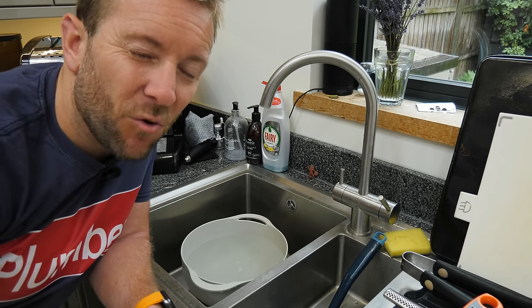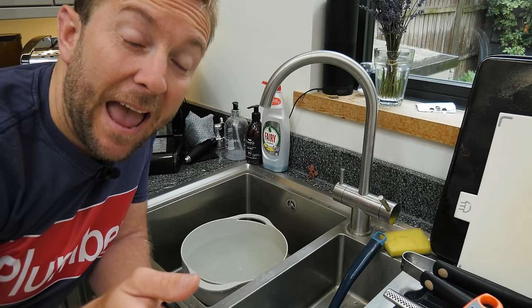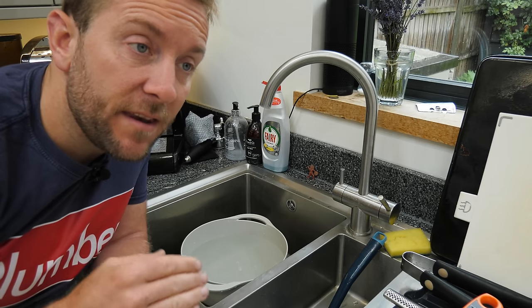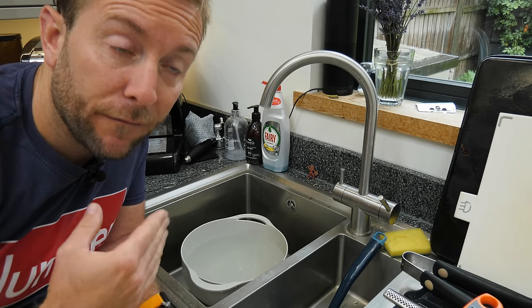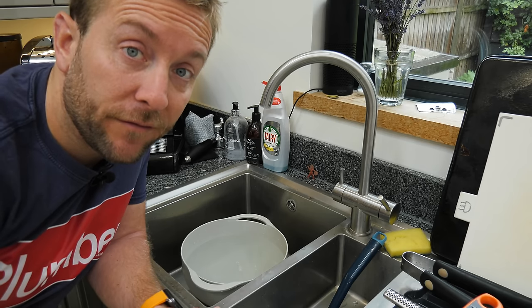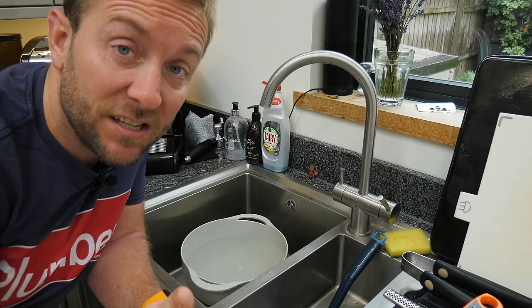I mean, I'm a bit naughty. My tank, I'll heat up to about 65 degrees. Throughout the day, if it hadn't been used all day long, by the time the next heat top-up cycle came on at say 4 or 5 in the afternoon, the overall loss of heat was about 5 degrees. So really negligible. It didn't even go that far, it was like 62 degrees.